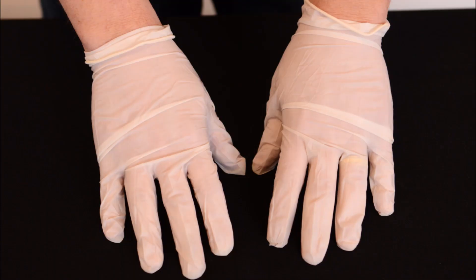When handling fiberglass cloth, it is important to wear protective gloves because dry skin can snag and distort the fiberglass cloth. Wear latex, vinyl, or neoprene gloves for best results. The gloves will also protect the cloth from the oils on your hands. The oil from your hands can impede the adhesion of the resin to the fiberglass cloth.